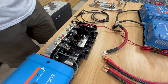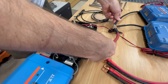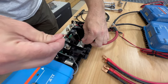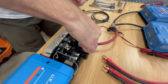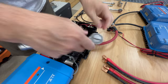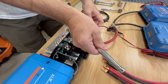You want to leave that little ring terminal in there from Victron, but otherwise we put this on here — this goes to the negative bus bar. Then your washer, lock washer, and nut. Follow their torque specs; I don't have a torque wrench, so I have to make a guess.